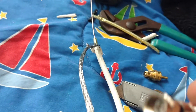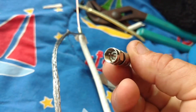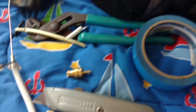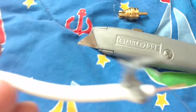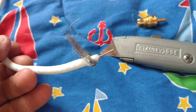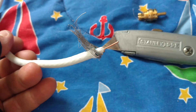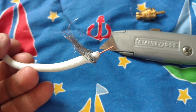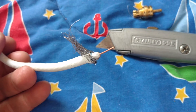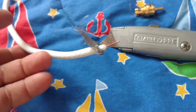I took the other part and cut off the plug — this is the plug you screw into your TV — I cut that off and threw it out, we didn't need that anymore. Same thing: separated that grounding material, exposed some of the inner copper wire, and peeled back the shielding, which is going to become the ground. Now, I'm going to plug this working end right into where the VHF antenna plugs into the VHF radio, and we should get reception.